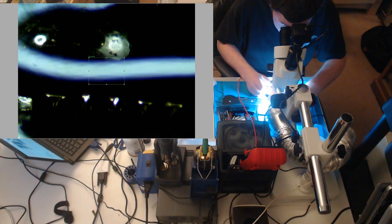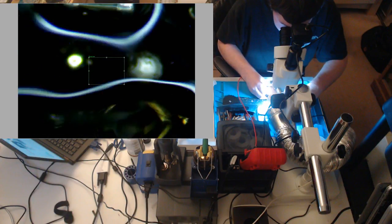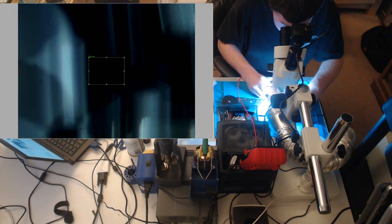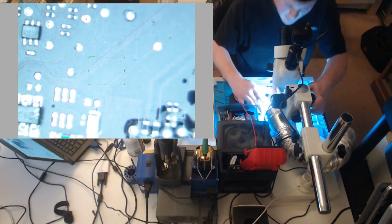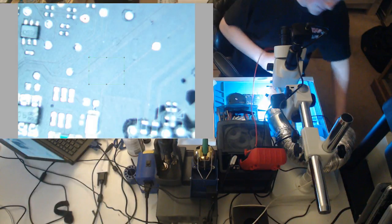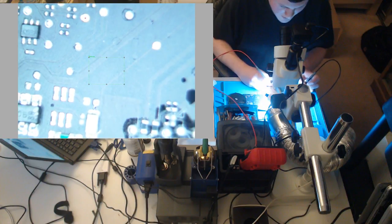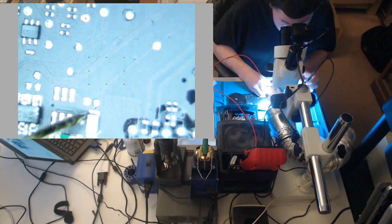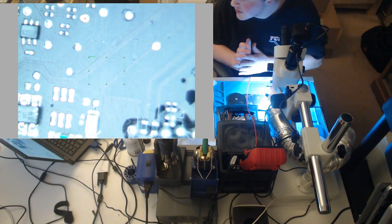Alright, so now that our ISL is being told to shut off right away, what could cause that? And current sense is usually not going to do it. What'll do it is a short, so we need to check on PP bus G3 hot for a short. Now, this sounds crazy, but we know our other ISL was not bad. I've gotten trolled by bad chips before, but I don't think this chip is bad. Alright, now we have a dead short on PP bus G3 hot, so what shorted? My guess is what shorted was one of the FETs, Q7035 or Q7030.